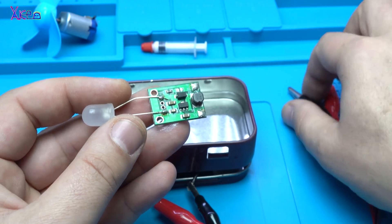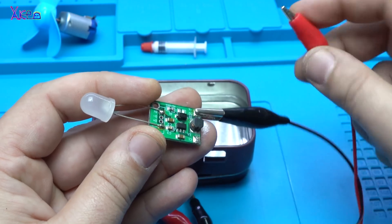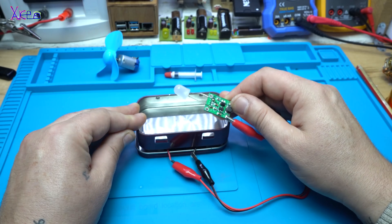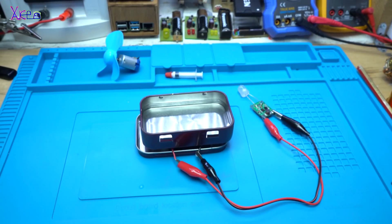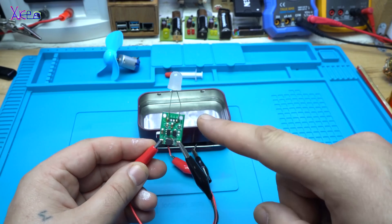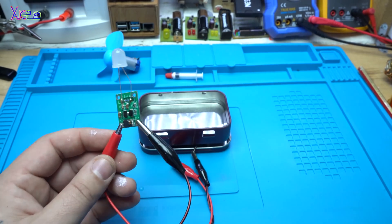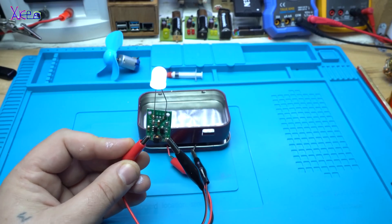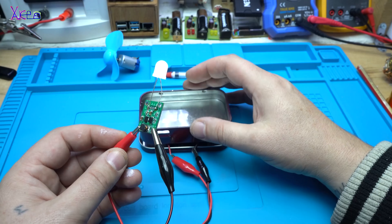It's a small DC-DC booster and I hook up a white LED — negative and positive. You can see that it's not working because the water is not hot. Let's pour some hot water. And look — the LED lights up, producing electricity from the thermoelectric generator.